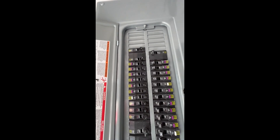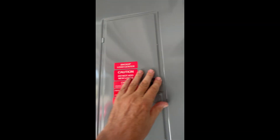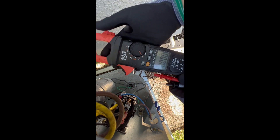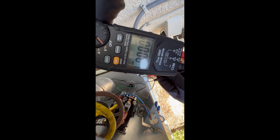We're ready to change over — I've gone as far as I can without interrupting power. Important: we want to make sure the AC is off. Don't want to work on it live. Always make sure the power is off — never assume and just go for it. Always make sure it's off. Touch on the contactors here — two volts, yeah, I'm not too worried, it's off.